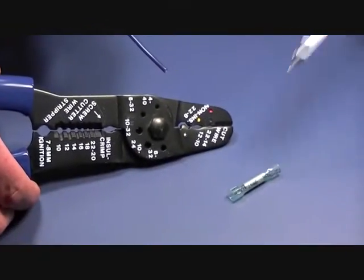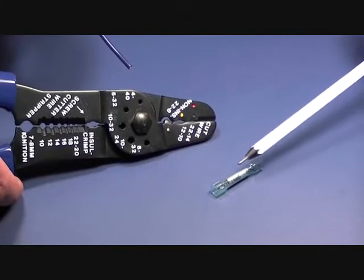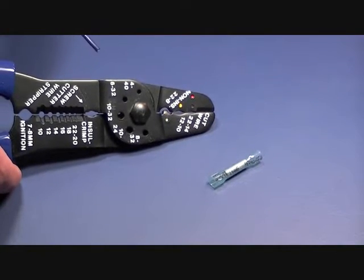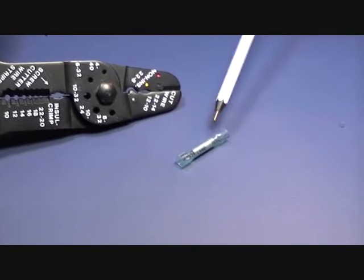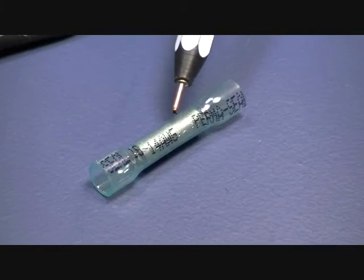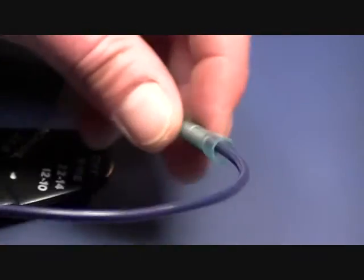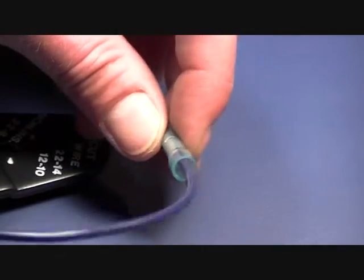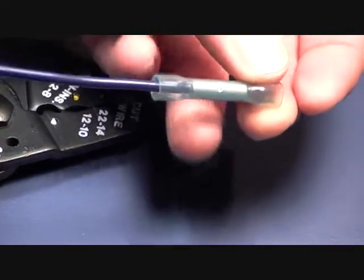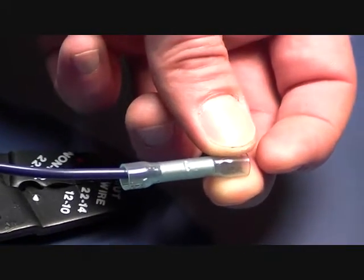Some of them are shorter than this. We have all American-made product and they have long barrels, but there is a stop in the middle and you can't push the wire past that point. You don't want any exposed wire back in here. You want to insert all the copper strands as much as you can into the barrel itself. See there — it goes right in. Perfect fit, no jam problems, and it's nice and snug up against the barrel, and that's what you want because you don't want to expose any of the copper stranding.